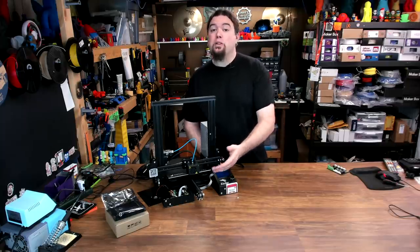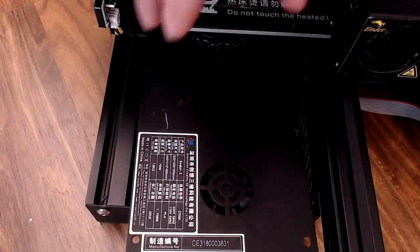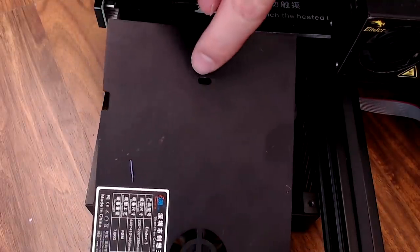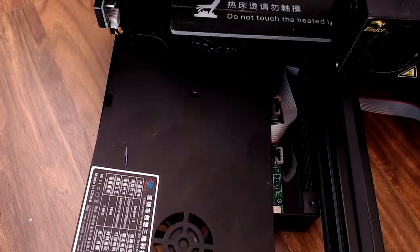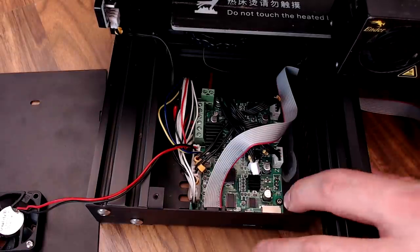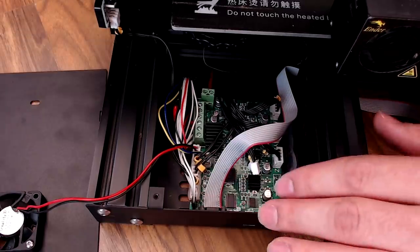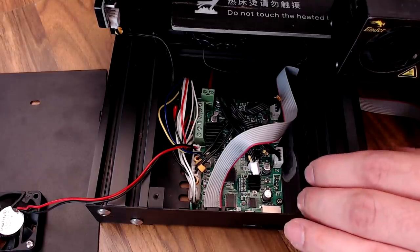Let's go ahead and get started removing the old board so we can swap in the new one. The first thing you need to do is remove the cover - there are two M3 screws in the front and a slightly longer M3 screw in the back. You get to the front two with the bed all the way back, then push the bed forward to get to that back one. Before you start removing wires, I recommend taking quite a few pictures with your cell phone, or get in there and make some labels. A lot of these wires are labeled pretty well already, but a few extras won't hurt.